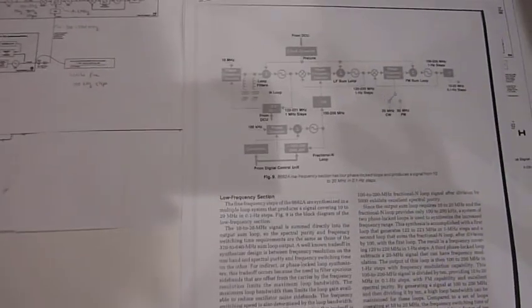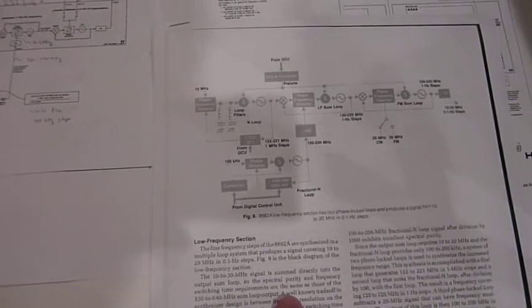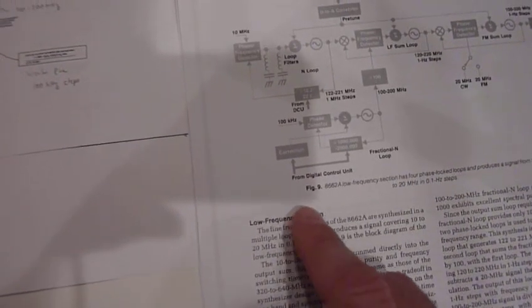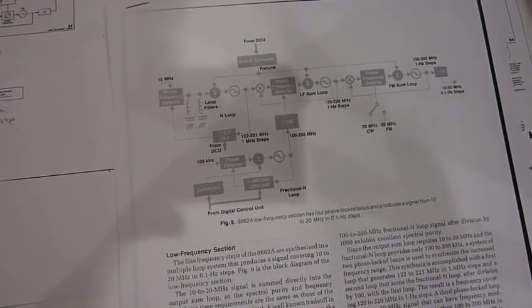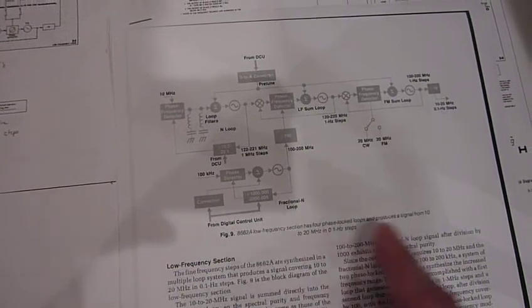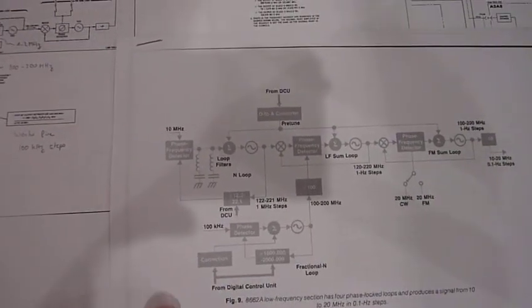I could figure out — it explains a part of the circuit that has trouble, and the way it synthesizes frequencies: it synthesizes per bit. The two higher or three higher digits are one VCO loop. Then you have an N loop that does the two next digits, and a fractional loop that does all the other digits from 0 to 6. The way it's built up together is the fractional loop digits are added to the second part of the frequency, which is the N loop, in the sum loop.